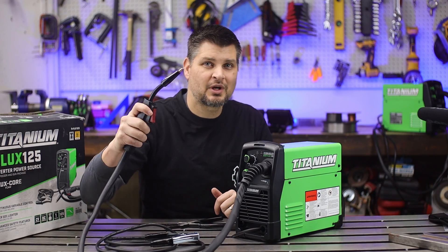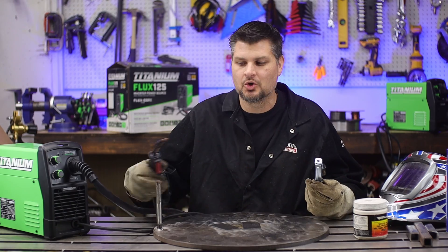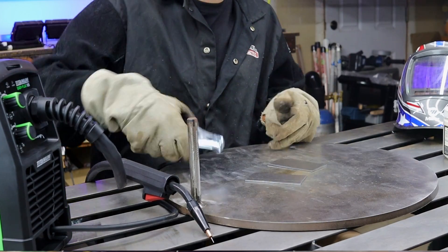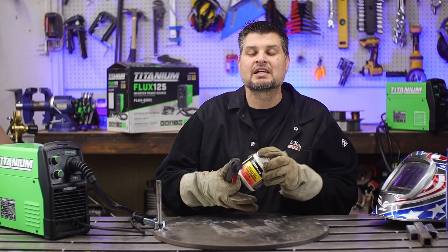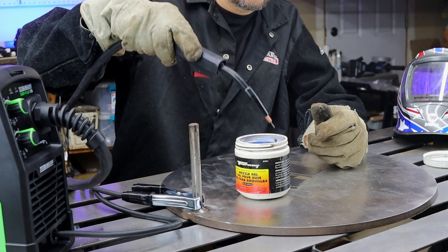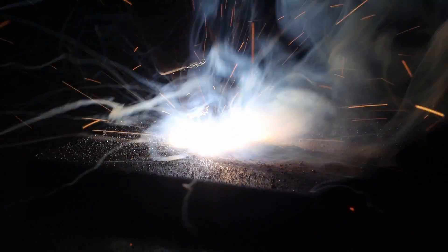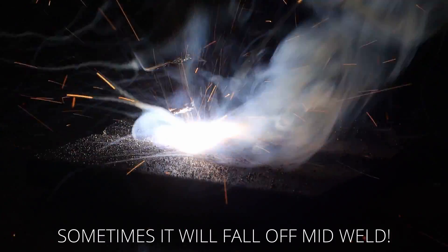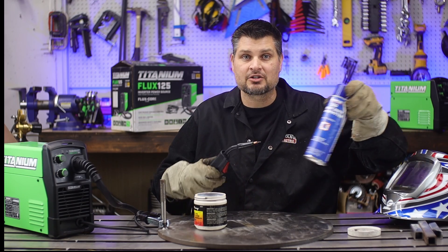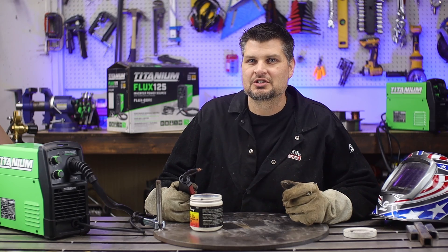Three to five minutes and we're ready to weld. Welding uses electricity, so you use your steel metal piece to close that loop. You have to connect your ground to either the work piece or, if you've got a metal table, just connect it to that. To save your nozzle and contact tips, I use nozzle gel — link in the description. Just dip it in every once in a while and that's it. The little spatter balls from flux core will just brush right away. You can also add spatter spray to your work piece. These two won't affect weld strength but give you a nice clean weld to show off.